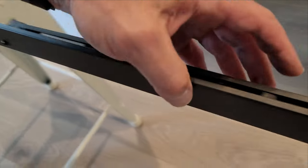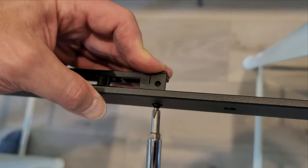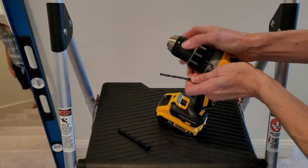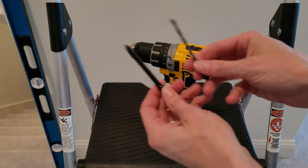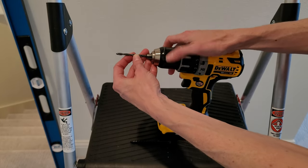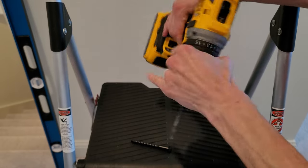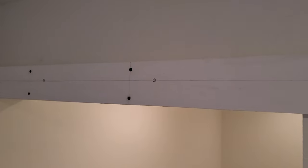There are spacers — in case you're wondering, the soft close sticks out a bit — no worries. The spacers pull the rail away from the header board. We're using large lag bolts and ended up using a pretty big drill bit, but not too big, because we want a large enough pilot hole to not split the wood but not so big it's loose. Make sure your drill gun is set to two and the drill setting, then go ahead and drill pilot holes across your header board.